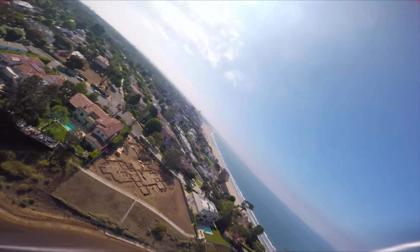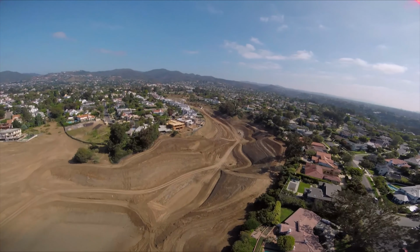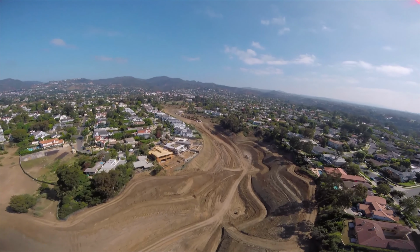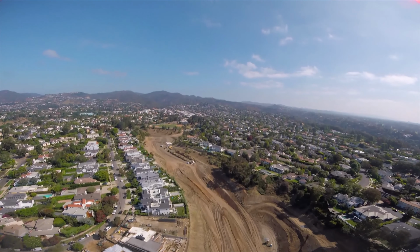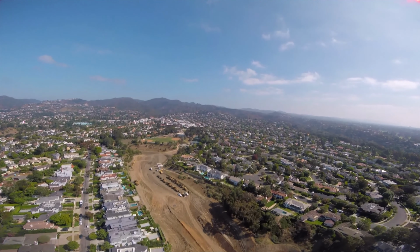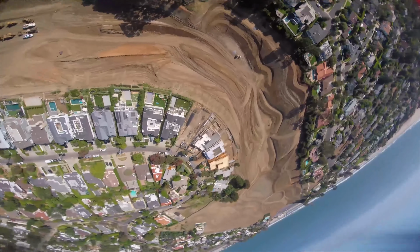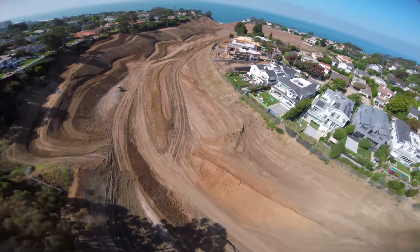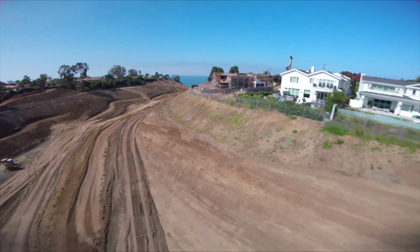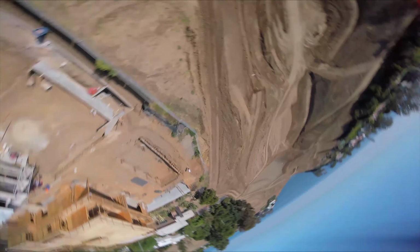Moving up to the 2212 gave me all of the throttle control back, all of it. It was phenomenal throttle control. However, the bobbles were insane. And back then, I was running the Helio stuff, and I did try some Betaflight boards, and the bobble was way worse. As soon as I threw a Helio board in there, it was significantly better. I had really good luck with the Helio tech, and I really do think there was something there. However, a lot of people object to that, whatever it was. After that, I gave up on solving the bobbles. I tried a little bit, but I just totally gave up.